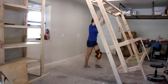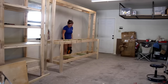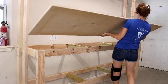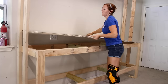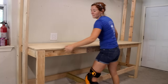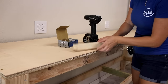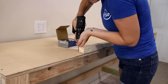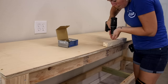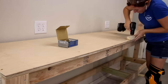I decided to stand the unit up and deck it. Even though it's big, it is still pretty lightweight at this point, and I always think working with gravity is the best route. Once the workbench is upright, I started putting sheets of plywood on all of the shelves, starting with the main work surface. The bench is designed so that clamps can be used on the front lip to hold items down, which makes it tricky to screw down to the frame. A tip is to grab a 2x4 scrap to act as a spacer — it's the same depth as the overhang, so you can flush it up to the top side and it gives you a reliable visual on where to place a screw to hit the frame underneath.